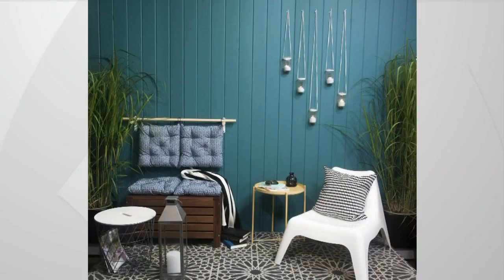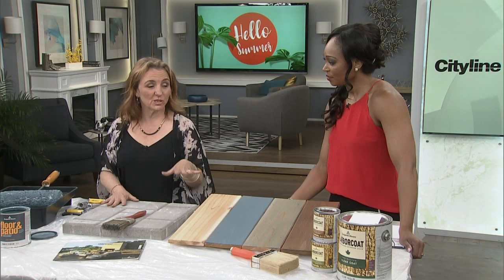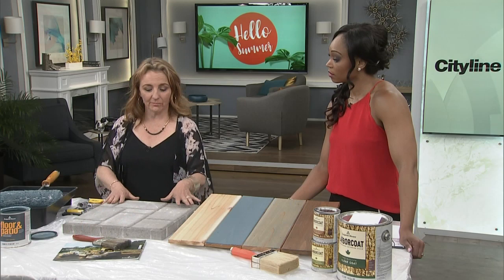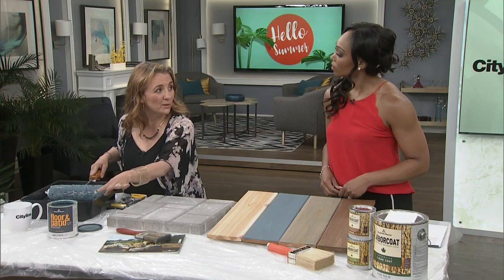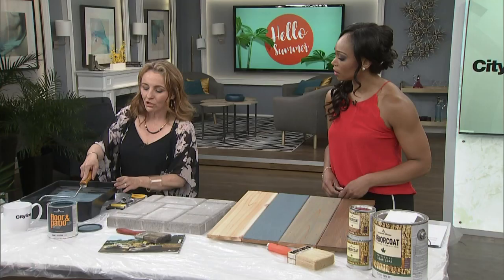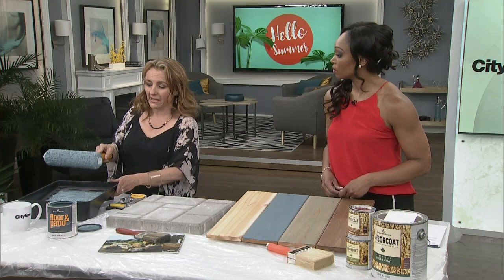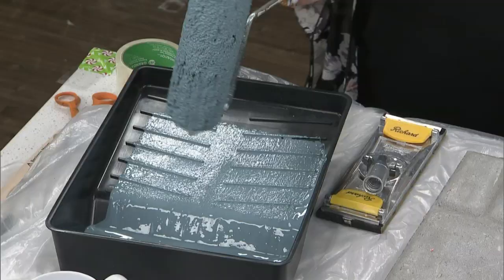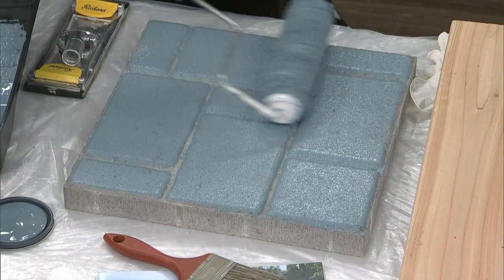If you're using concrete, there's gorgeous concrete decking with patterns using a big beautiful stencil. But if you don't want to do the stencil, you can at least get rid of that boring concrete look. Use concrete paint — same thing, make sure it's dry since concrete is also porous. I love Benjamin Moore's latex floor and patio paint; it's self-priming on concrete. You want to use a good 15-millimeter pile roller — heavier than what you'd normally use for wall paint — so you can get into the surface.